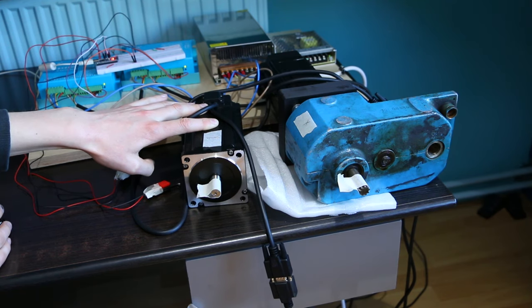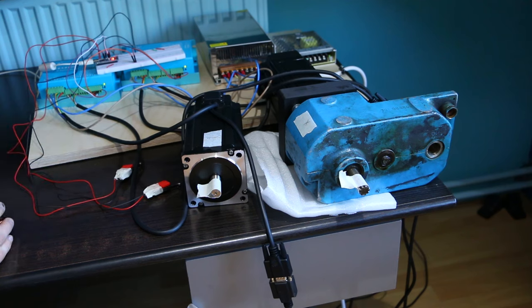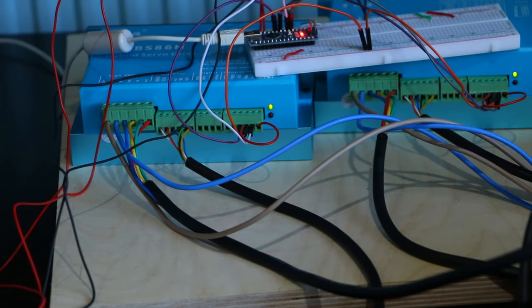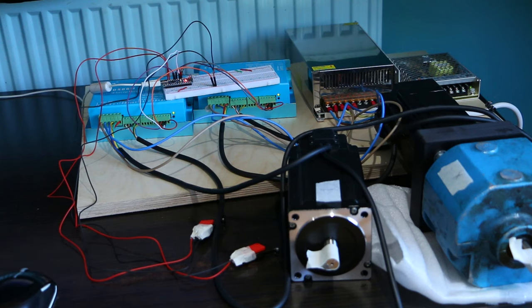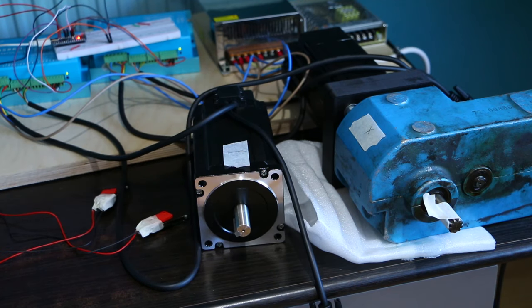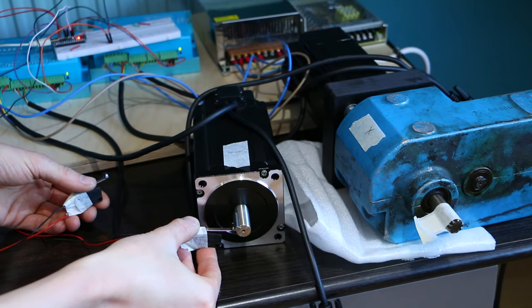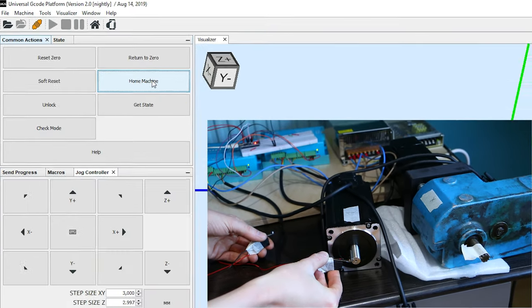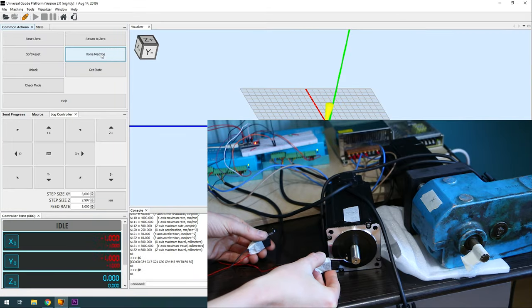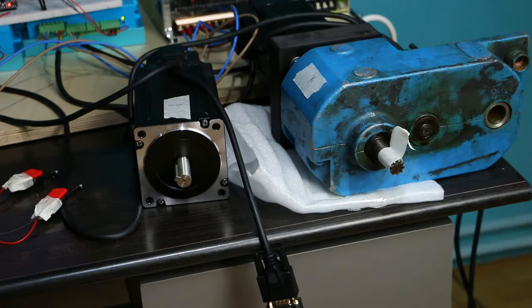What you just saw is that I stalled the motor — I sent more pulses to the motor than the motor can handle. A normal stepper motor would try to keep spinning while the axle stops moving, making a strange pitched sound. The encoder from the closed loop stepper noticed that the motor stopped moving while it was still receiving pulses from the controller. This triggered an alarm mode and the driver shut it down. After powering the drivers off and on the alarm mode went away and the system could be used again. You don't need to be scared of stalling the stepper motors during calibration because it doesn't do any damage to the motor or driver.